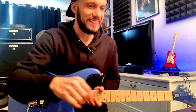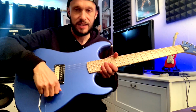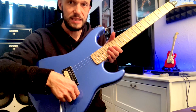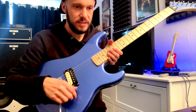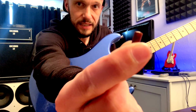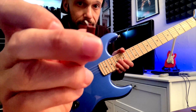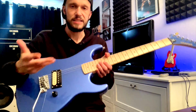And the other thing you have to do, because this volume control is like an on and off switch when you first get it. So you can have it on full volume, turning it down makes no difference to the sound whatsoever. Keep going and then it just cuts off. So that's not much use. And that was because it had this treble bleed thing, which you might be able to see attached to it. So I had to cut that off. It's just got 2 little legs like me, and you just snip them and it comes off.